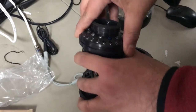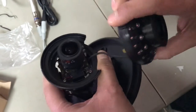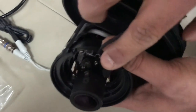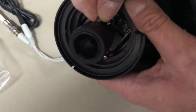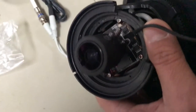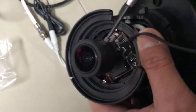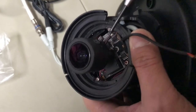Now we're going to show you how to use the lens. The lens is accessible by popping off the top — be very careful. There are lens adjustments on this camera. They are taped from the factory when shipped so the lens doesn't move due to temperature changes. To adjust the lens, unscrew the locking screw just a little bit — don't completely take it out — and use a hand screwdriver carefully, otherwise you'll break the lens.